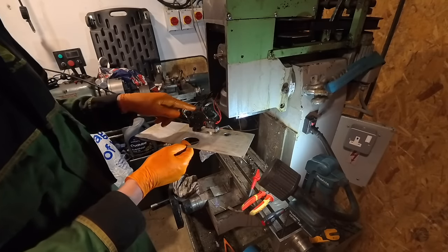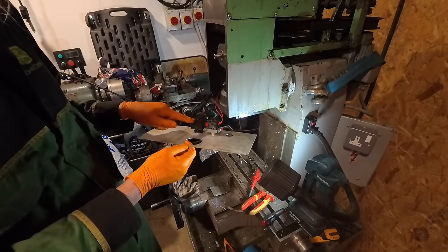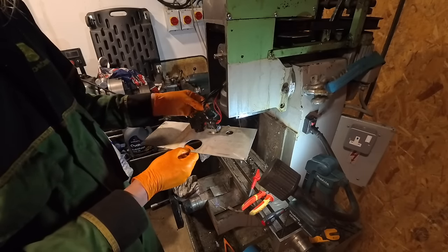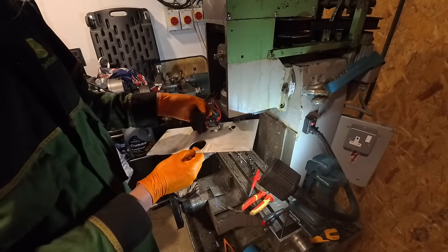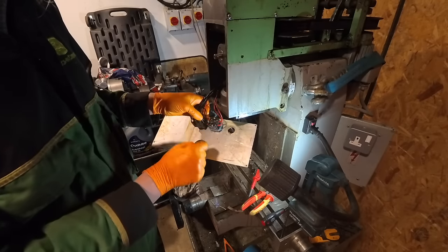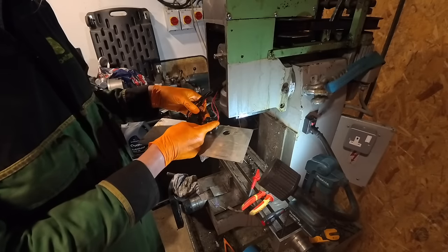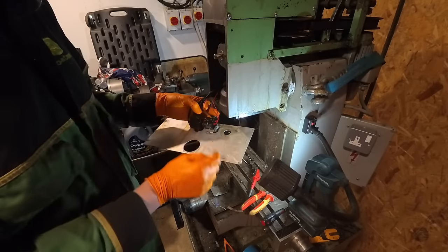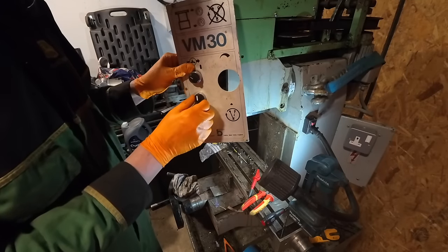It's a little bit hard to see some of this wiring, but this old switch is going. I just don't have the new one yet. I also don't have a suds pump, so it doesn't matter that much. But you've got the communication wire or the signal wire there, and it's connected to both switches. See these two as two separate switches, and this was the start wire originally, so that's forward. And then what was the stop wire in this switch is now reverse. So now on this new switch, I've got forward and reverse.